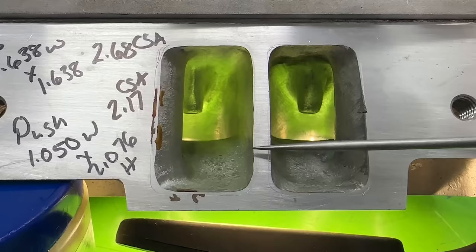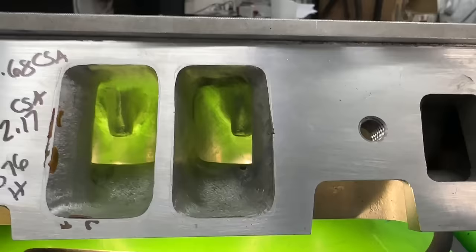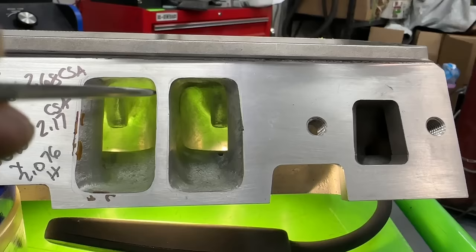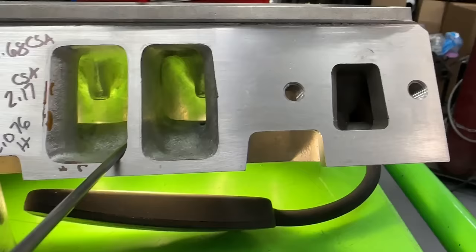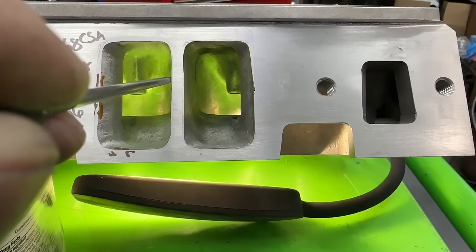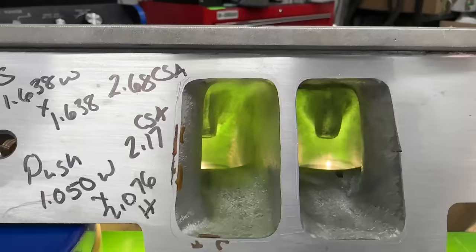You can keep your lines a little bit straighter - and I do that too sometimes. What happens when we're grinding is a lot of people go up and down with their burr. If you go up and down, you dig in here and you dig in there, but what's right through the middle doesn't get as much. The reason why is your burr stays longer at the top and bottom when going up and down like that. The way to prevent that is: you go down, move away - drag down, off, drag down, off. I'd start here and just go straight through the center until I could get that to the same. You're not that far off, though.